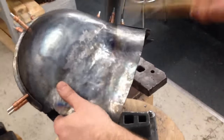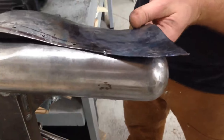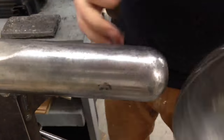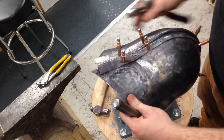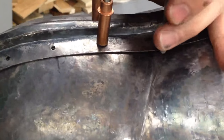Now I'm just trying to flare up this skirt a little bit. I'm using a cross-peen hammer and basically putting a whole bunch of little cross-peens in and then hammering them flat. What that does is it stretches the metal out and causes it to flare out in both directions. Now I'm working from the inside of the helmet on this crease again, just straightening it up and making it look exactly the way I want it to. On the comb, I've got to use a cold chisel that is all rounded smooth, and I'm just going to pound it down into that matching crease.